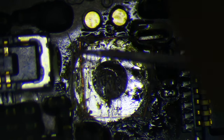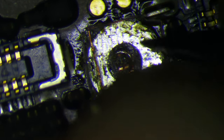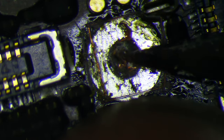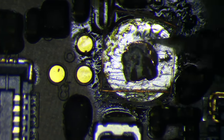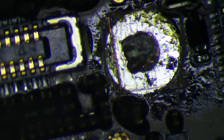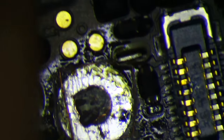That's just habit — scoring the board like that. I don't actually need to cut that much out. If it was spongy, then I would definitely want to do that, but that was just muscle memory taking over. I don't actually have to expose that much of this area — I've just got to kind of dig this out. The trace is very, very rarely severed. It's almost always just that top layer going down into the trace in the second layer that runs right along here. There's no point in exposing down to those traces unless it doesn't have image when I test it.